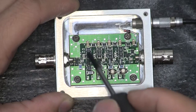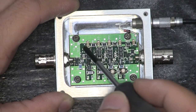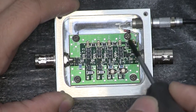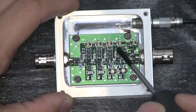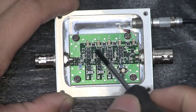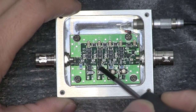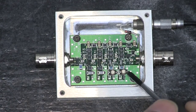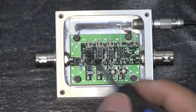This is the input port, this is the output port. These are all identical power filter circuits coming in from the power rail on top — power comes in this trace, underneath all of these capacitors that are decoupling it to the ground plane, which is coupled through the case. There's no second wire, which would almost imply this is aluminum rather than steel. All these power filter circuits are identical with different values of resistors and capacitors to smooth things out, and then you've got RC networks here with room for additional components. Interestingly, they use trim caps that are the identical footprint as other capacitors so they can just slot these in as needed.